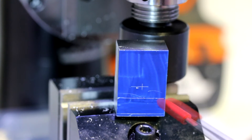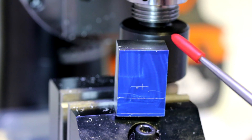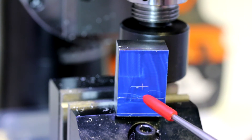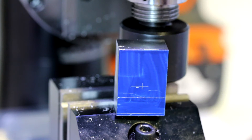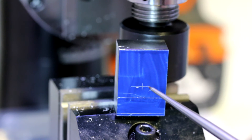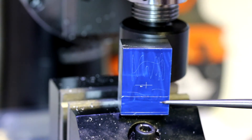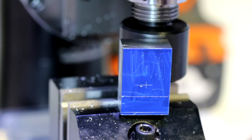We need one more mark, which is 0.76 down from the top face. I measured the thickness of my saddle as approximately three quarters of an inch, so I want another ten thousandths — this will be where we take our step to, maybe just ten thousandths beyond that. We'll first drill our hole, then put a small counterbore in it for a spring, and then mill away this face up here, leaving the lower face protruding so it will engage into our base.